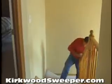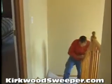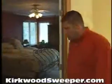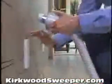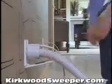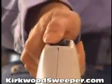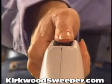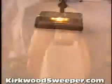Now, with the system running, walk through your home. If you hear whistling or hissing, you may have forgotten to glue a connection. Be sure to check the basement and attic areas too. Have your helper plug the hose into each of the inlet valves to be sure you can turn the power on. Turn off the switch on the hose handle. If it does not shut off, the low voltage wires are crossed somewhere, usually at an inlet valve.